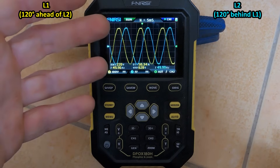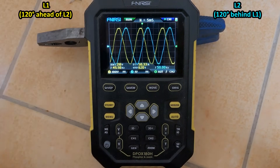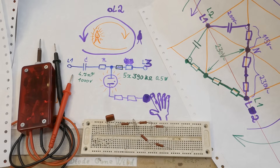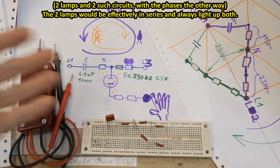You don't necessarily have to probe three phases. On a two-channel oscilloscope you can see how this phase — the yellow channel — is 120 degrees before the blue channel phase. This is a very handy two-channel non-grounded battery-powered oscilloscope; there's a link in the description where to get it, and I'm using it with 100:1 probes. The lamp in the two-probe tester is somewhat dim because you can't pass much current through a human without giving them a shock. Also, if not in direct contact with ground, only capacitively coupled current flows, which is always quite low. Because the ground connection is such high impedance, you can't really make a two-lamp version — the two circuits would influence each other.